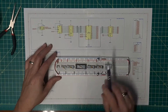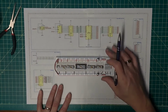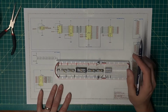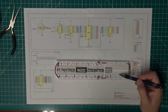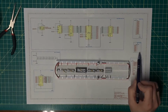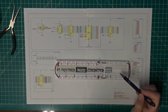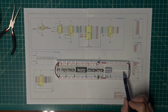All right, so behind that, I now have an output of all the different hookups that I need to do. This is not nearly as in depth as the Control ROM control circuit, but it's still very dense. I still have a lot of things I need to fit in here, including my address input, my control pin input, and my signal output. The signal output will come out directly off the latch here. So again, very densely populated board. I'm going to start over here on the farthest and work my way back this way.